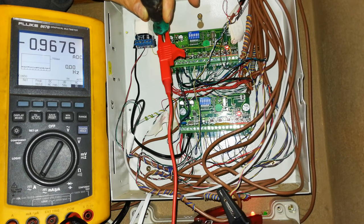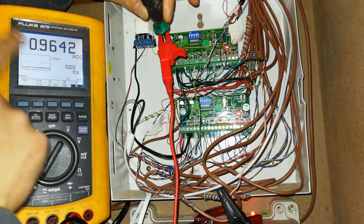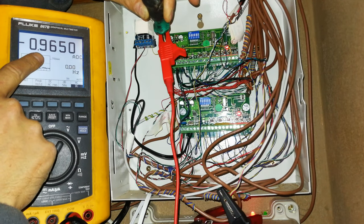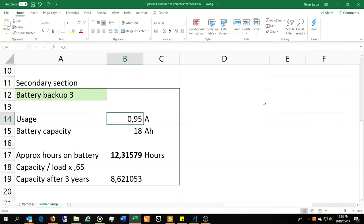So what I want to do now is do the calculation and tell you how many hours you'll get on an 18 amp hour battery when it's drawing one amp. Keep in mind, if you're activating your sensors or the remote receiver, that'll easily go over an amp. So here I have a little spreadsheet. I've put the battery capacity at 18 amp hours — I know it's more common to find a 17 amp hour battery, but I have an 18. The current drain is 0.95 amps and the hour backup time is just under 12 and a half hours.